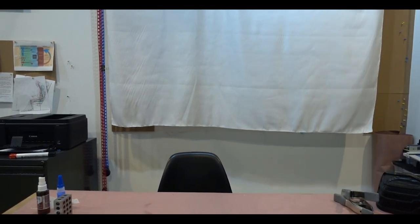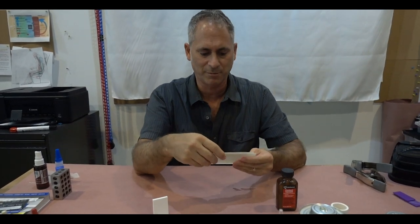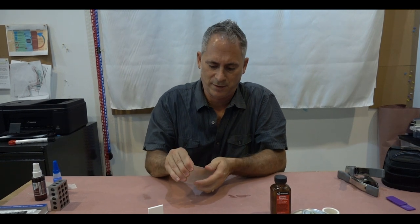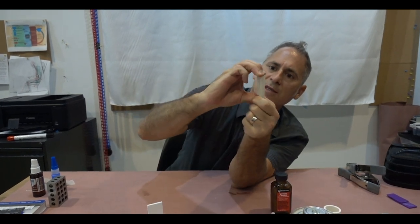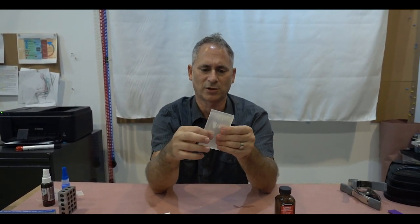The contact cement test — this one was done using a rubber cement, equally effective with a spray glue. We put it on the two halves, let them dry until just tacky to the touch like masking tape, then pushed them together. The great thing is this won't break from bending and flexing. I can create a peel situation where I can get it to lift off — you can see that. So rubber cement can break under extreme peel, but it's got great strength otherwise. If both pieces were flexible, that peel would never happen. Rubber cement is a nice alternative when using flexible materials.